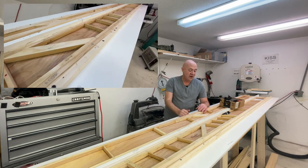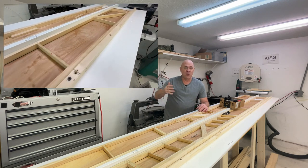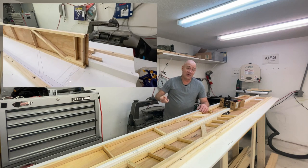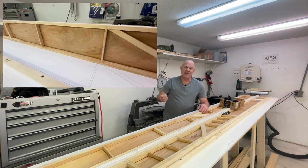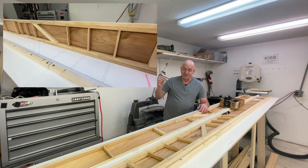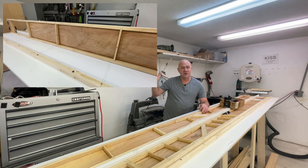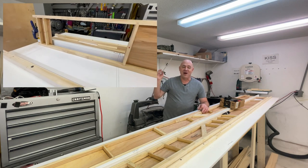The build manual for the air bike states that you can build the spar cap strips out of spruce or Douglas fir. I was able to find some Douglas fir, and there's yellow pine in this, plus eighth-inch and sixteenth-inch birch from Aircraft Spruce and Specialties that make up the shear web. I use T88 structural adhesive — the longer it takes your glue to cure, the stronger the joint normally is.